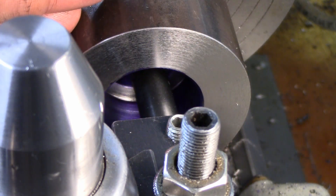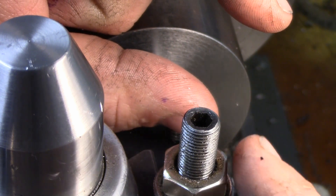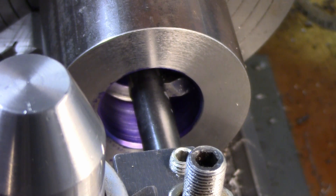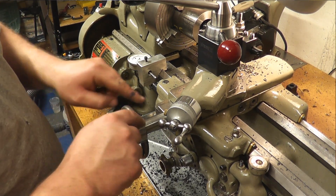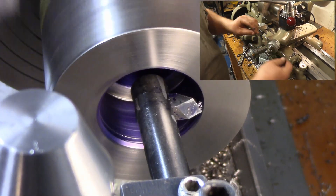As we go deeper we're going to go slightly forward, but this will give me enough room to go throughout that entire relief groove thickness. We're going to start out on this side, and as we advance the compound when we thread, we're going to be advancing slightly further toward the front of that relief groove. I'm going to wind the compound back and come out to the front. I'll touch off and set up the other camera. My compound is zeroed and set at a comfortable angle — I like to keep it horizontal — and we're just going to come in and touch off just until we raise a chip.